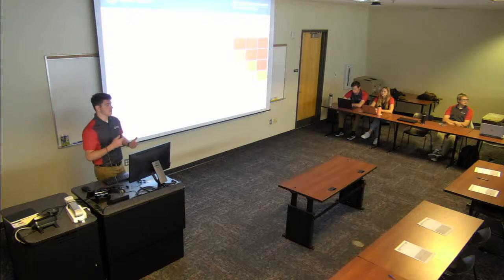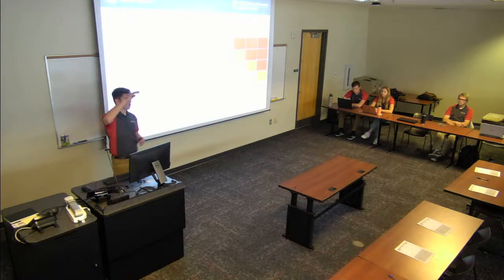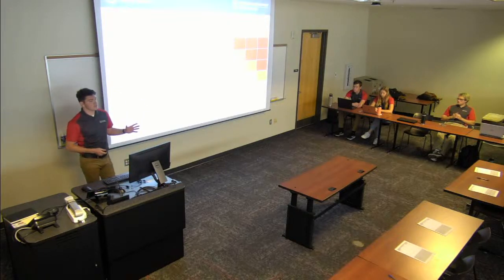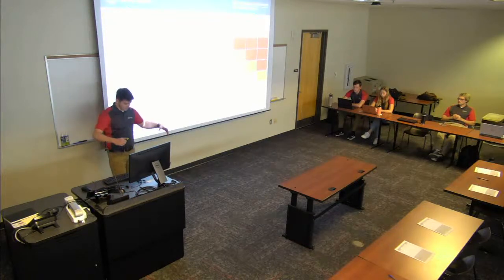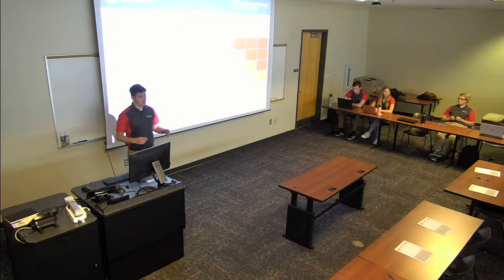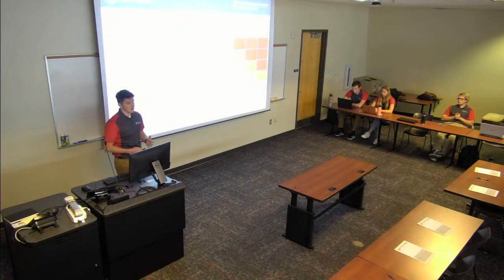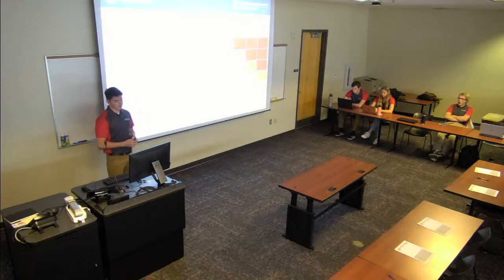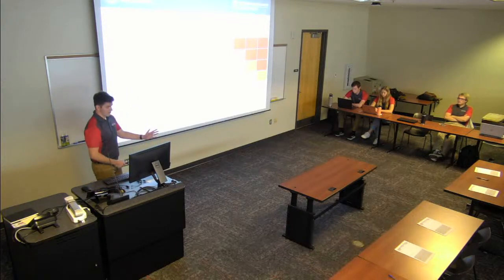We want to make sure we have checklists, in order. We want to make sure we have everything documented so that day of we just follow an order and we're good. And orientation lines are when you're putting together the rocket on the table. You want to label lines so that you know exactly how you want to orient everything every single time, and that there's no thought of, oh, maybe we should have shifted it 180 degrees or anything like that. Everything is just lined up perfectly. You have a successful integration.